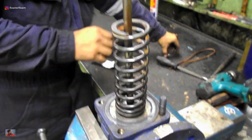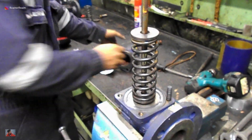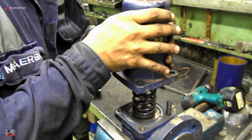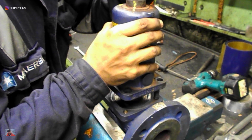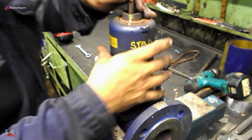Next comes the bottom spring carrier followed by the spring and then the top spring carrier. The gasket in between is already in place, so next comes the valve bonnet. Use the top part of the spindle valve stem for guiding — it should go in freely without any trouble.